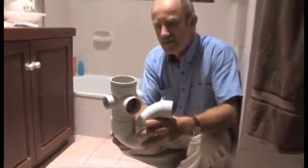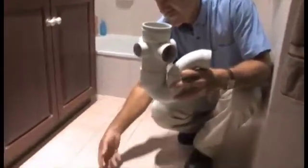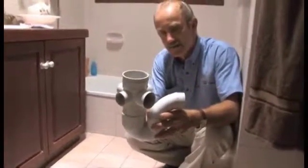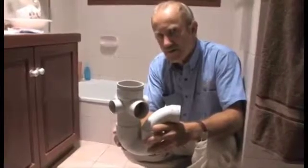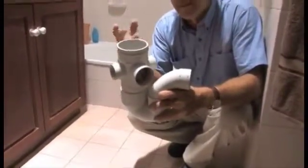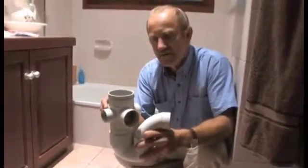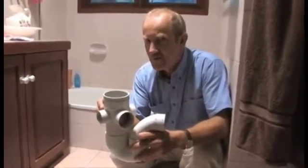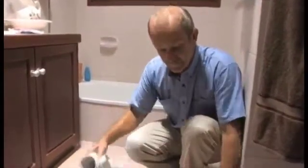Now, there's a tendency for bits and pieces of hair and soap and fat to go down inside this grate and accumulate down the base there. And that can be quite difficult to unblock, particularly if the grate is missing. It allows much more stuff to accumulate. So if you see a house where the grate is missing, you should immediately try and replace that grate. They're fairly simple to replace.